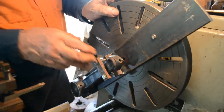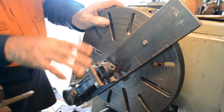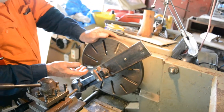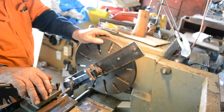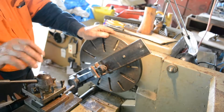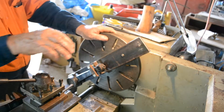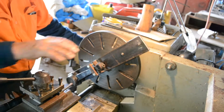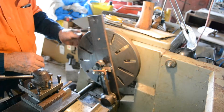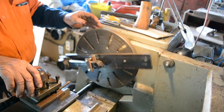I've kept the speed down. Really, it should be running at somewhere near 600 RPM, but it throws it out too much - the whole lathe shakes. It's got no vibration in there. This is a very good lathe, a Colchester. It's got roller bearings. You won't get any eccentric movement because of out of balance. If you're working an old English lathe with bushes in it, white metal bearings, you may have to put a piece of metal here to balance it up. But you can weld something on here to get it balanced. For these lathes, I don't worry about it.